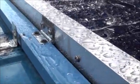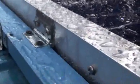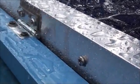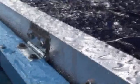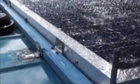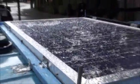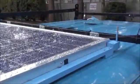The panel is bolted with hinges on two sides, which will enable me to pull the cotter pin on two hinges on either side to angle it in whatever direction — either forward or back. If I pulled the pins on this particular side, I'd be able to angle it toward the sun that way. And on the other side are two more hinges — if I pulled those pins, I'd angle it up to face the sun the other way.